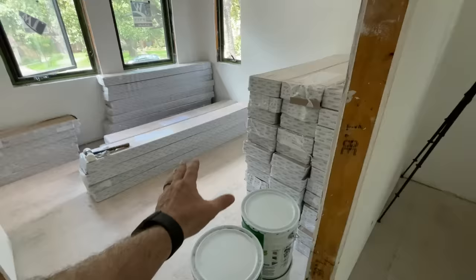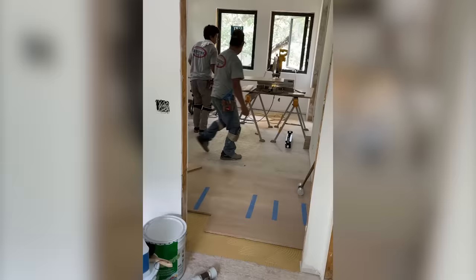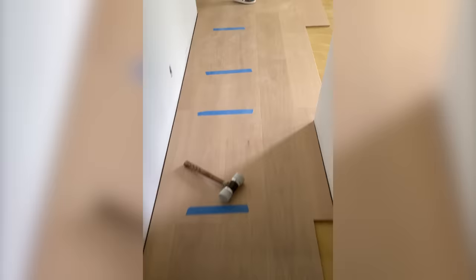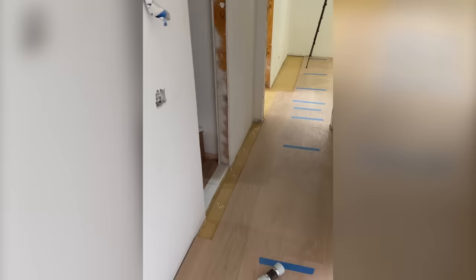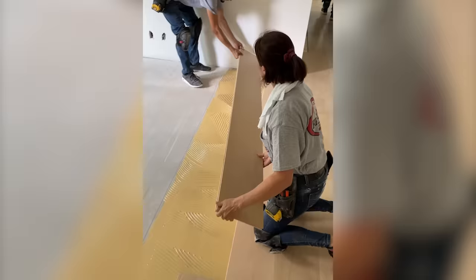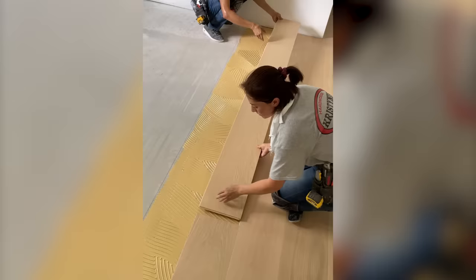Walking down to the boys' bedroom - the prep there turned out great with no problems. Hardwoods are prepped, so let's get into it. Wilson and his crew from Christine are doing a great job. This is the first round of boards - look how pretty those are! We're using glue, and they've nailed the starter strip. This runs as a continuous board from the top of the stairs. They've run a chalk line to keep the glue from going too far, and Emma's running the next run, staggering the seams nicely.